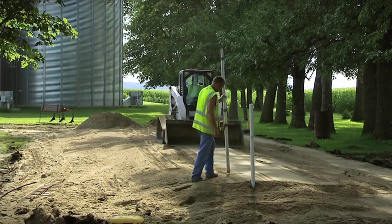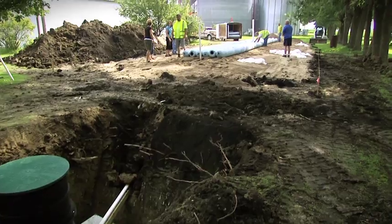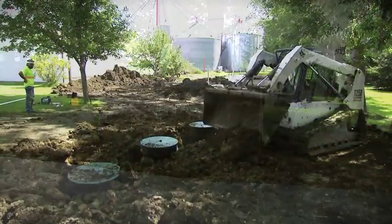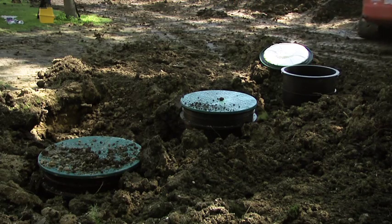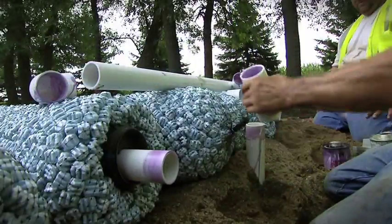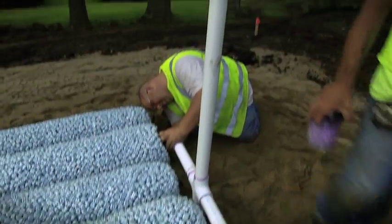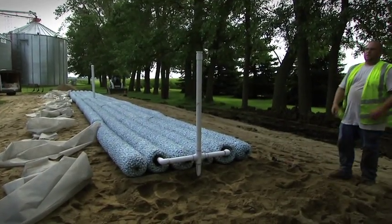Three-foot separation is what the sand is for. We had only a two-foot separation, so we have to install a foot of clean sand to get our three-foot separation from the water table. The manhole covers we like to keep at ground level just for accessibility — if you have to maintain, service, pump, or for pumping, you don't have to dig the grass off. The inspection pipes on the end — there will be three of them: one at the end, one in the front of the mound, and one in the middle. The one in the front is for clean-out purposes. The center one is just for checking the water level, showing you what the water table is at in your mound.